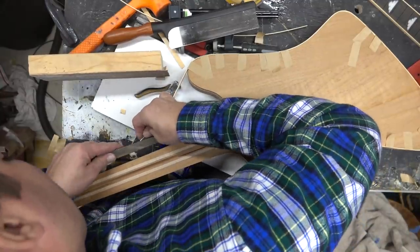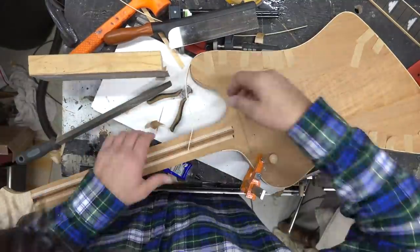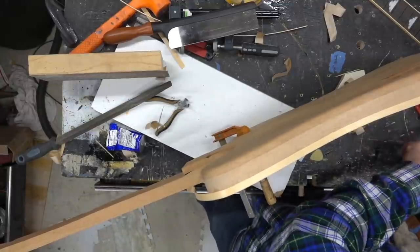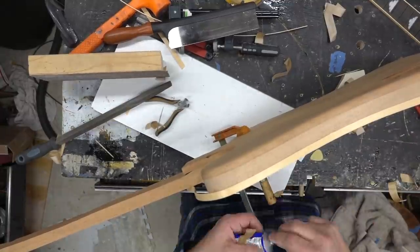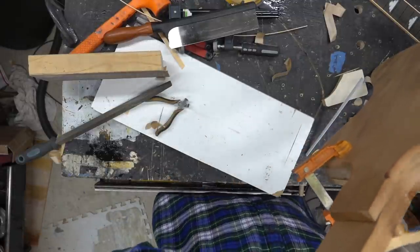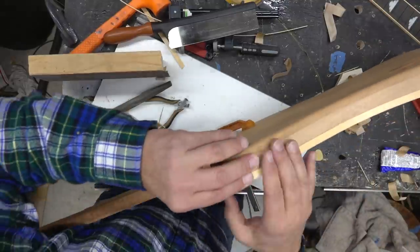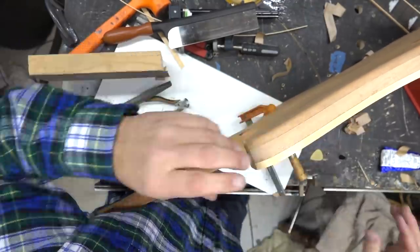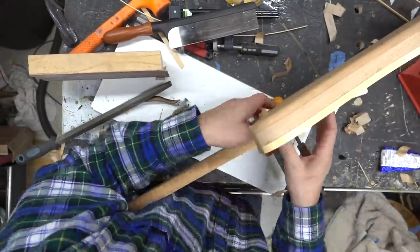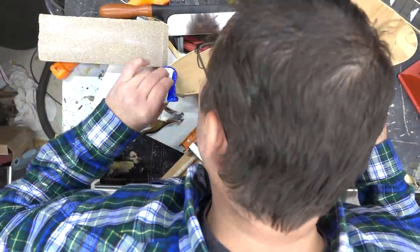This is an odd-sized guitar — you can see how wide it is — and edge gluing the binding in is a little bit tricky. Run the glue all the way to the edge and then tape it up. Don't be shy using the tape; use more tape. I really do like the tape over the rubber strip method.